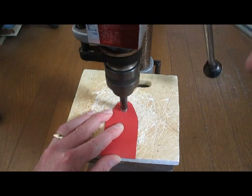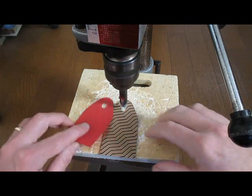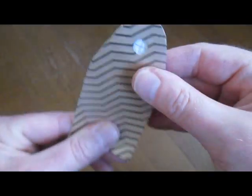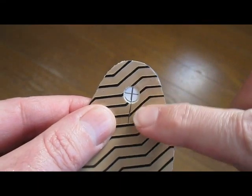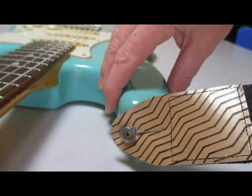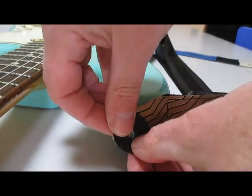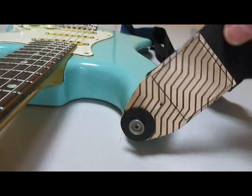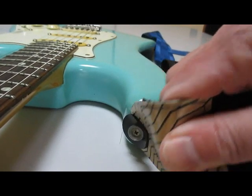Using the template I'm drilling an 8mm hole for the strap pin. Then using the template again, I can see where the slit line has to be. On this prototype the slit was actually too long — really it needs to only double the size of the strap pin. If it's any longer it may just slip off the end of the guitar even with rubber washer strap locks. So I recommend making a shorter slit than you see here.